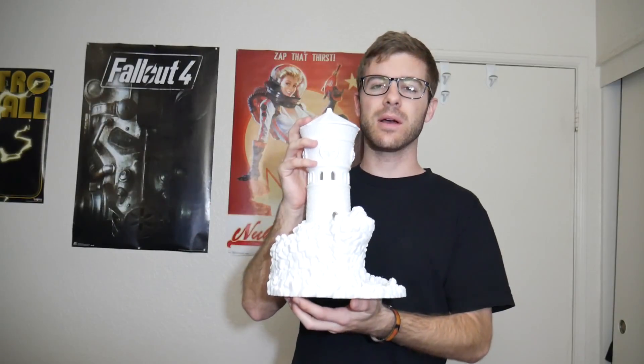Originally I was trying to use up little spools of plastic — this ended up being about a full spool, a kilogram of plastic exactly. I was using little bits of white PLA spools that I had, and the change filament feature on this thing is awesome. It's got a run-out sensor, so when it runs out it'll pause the print. The nozzle pauses, lifts up, goes off to the side, spits the filament out, you put a new spool in, click in, it extrudes, spits the plastic out, and I just pulled off a little excess on the nozzle, click resume, and it drops back over to where it was and continues. I only did that twice, because once it got to the bottom of the rocks I noticed some of my white PLA spools were slightly different shades. Although I'm painting a lot of it, I ended up just throwing on a brand new spool and finishing it off with that.